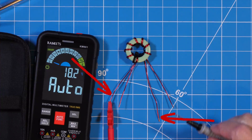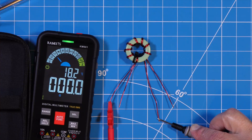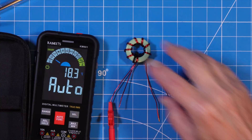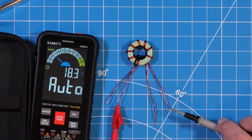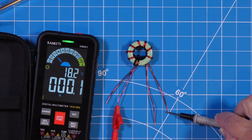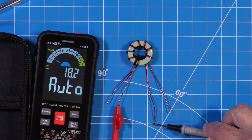Strip the enamel off the end of all four wires and check these two — if you have continuity, you are good. Shouldn't have continuity here. Go ahead and take that alligator clip and just move it over; this is just checking for extra measure. We've already proven we're right, but we should have continuity here — and we do. Once we put those two wires together in the middle, we'll have continuity between all three at that point.